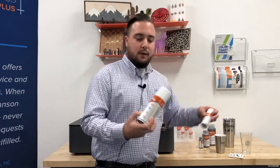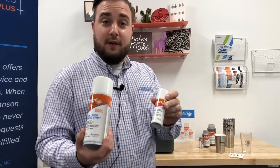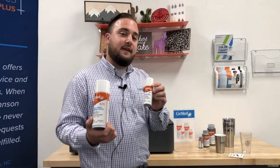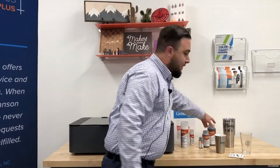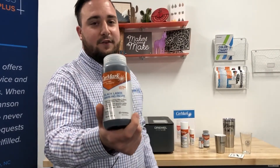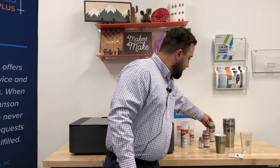The Cermark product is available in a few different configurations. You have aerosols designed to make it easy to apply — shake it for about a minute or so, maybe a little bit longer, to make sure everything gets mixed in thoroughly, just like spray paint. They also added a cool little sample size for you to try out and see how this fits into your business. And then we have three different sizes of the Cermark paste. This is a concentrate — you will need to dilute it at a one-to-one ratio with denatured alcohol or ethanol. After it's been diluted, you don't want to store it; just mix up what you need at that time.